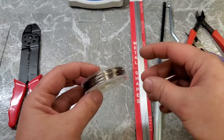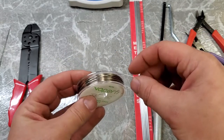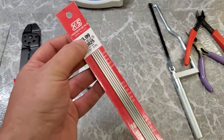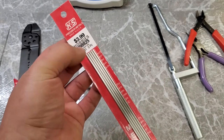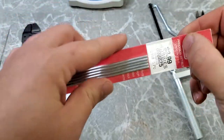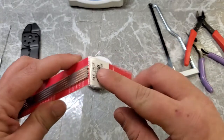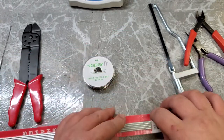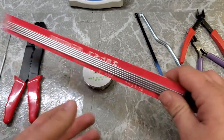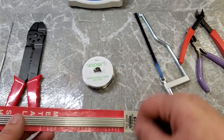This wire is nickel-based, and it's relatively heat-resistant and pretty corrosion-resistant too. I'm going to try to make some inoculating loops out of this vape wire and these aluminum tubes. I got these at Hobby Lobby — $3.99, so $4 for five of them. The nice thing about these is they're hollow, teeny-tiny tubes of aluminum. We can make a loop of the nickel vape wire and then put that down into these holes and crimp the ends. I have my little mini hacksaw to cut the tubing because I want various lengths.